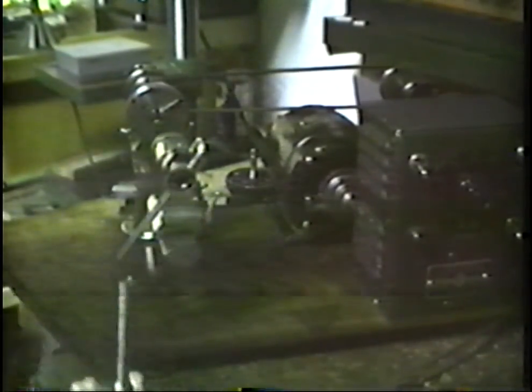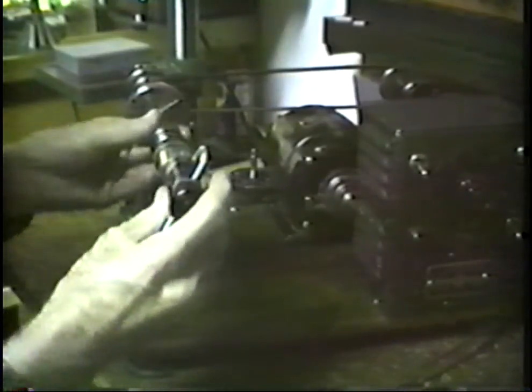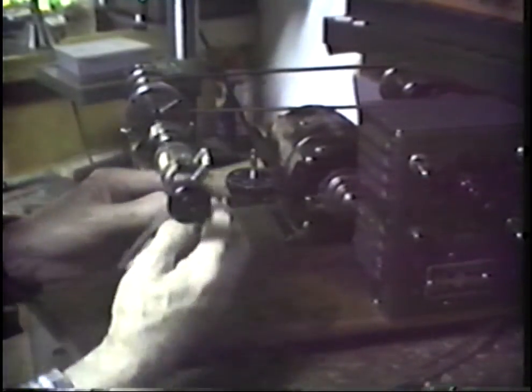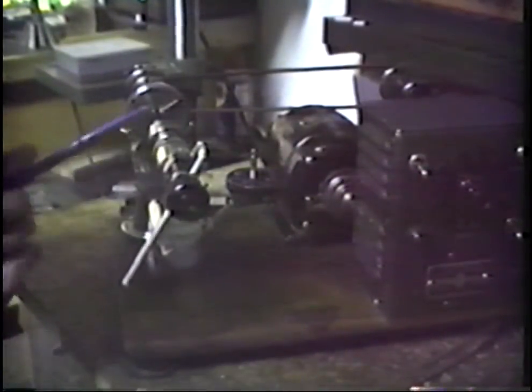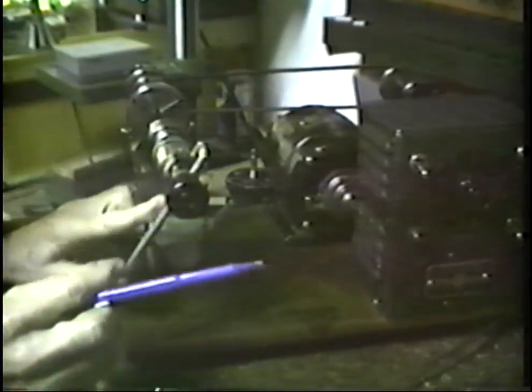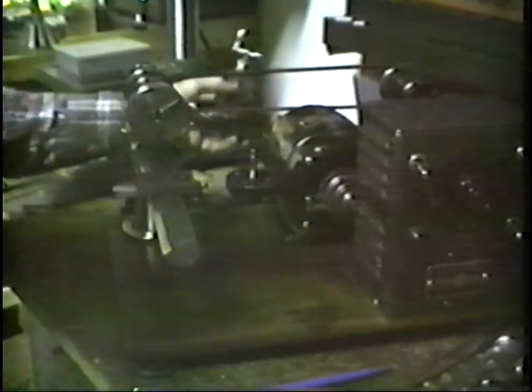It is a chuck holding tailstock with a drawbar. Being such as that, we can also use it as a drill chuck holder. We can set in a Jacobs style drill chuck that we have here and use that for drilling. I oftentimes drill in this lathe using a pad, a drill pad back here. Chuck the drill bit up front, rotate the drill bit, drill in between against the pad that is in the rear.